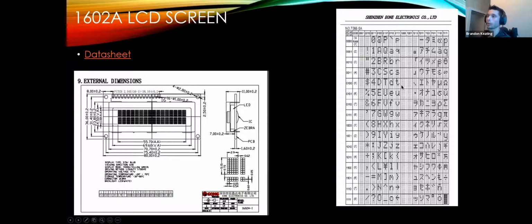So you can go into your IDE and go LCD.write and just send it a string and it'll actually just print it. But there's a lot going on in the background of this, which is why there are some preferences for other screen types, like an OLED, which uses I2C. That's only 2 pins. Then there's a TFT screen, which is another LCD, but much smaller. This is actually a TFT. It's a lot higher detail. It does full color, and you can go all XY. So you can turn this little LCD into something like an oscilloscope, where this is just kind of a bitmap.